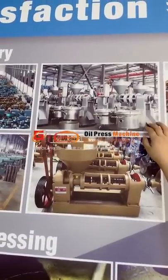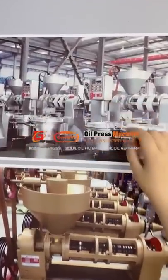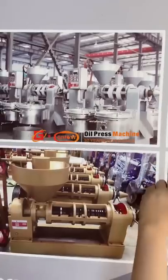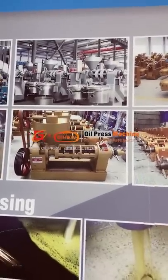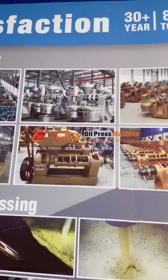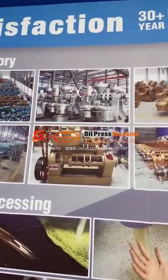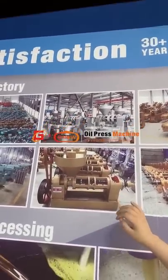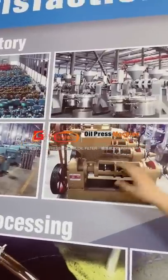This one will be an upgrade. You can see this one has two more tanks, and also a gear and operation panel. This we call the combined oil press. That means if you want to start an oil business, just this one machine will get you started. The two tanks are the oil filter, just to clean the oil. Because after this machine, you get the crude oil, which means the oil is not very clean. So we need another oil filter to clean the oil from this machine. This one combines both the oil filter and the oil press.